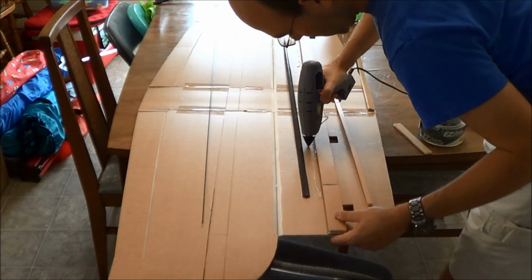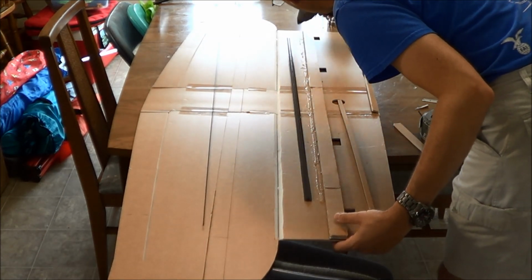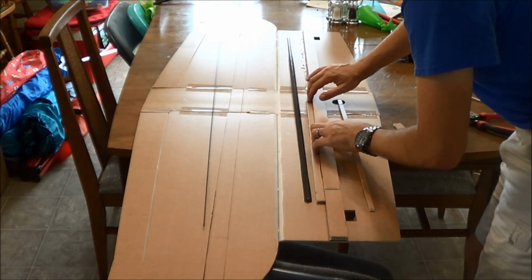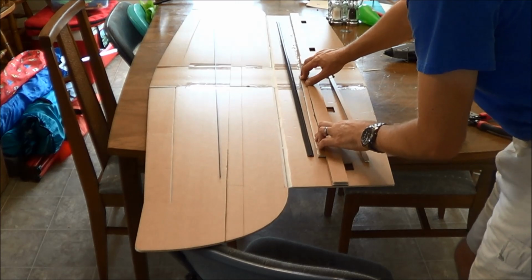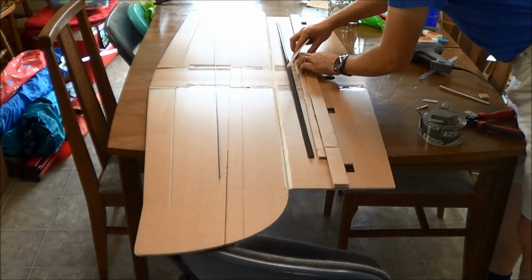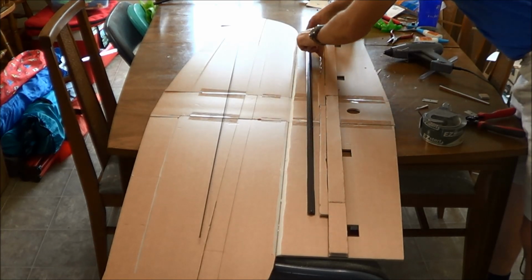And we can let this fairly secure into the bottom of the wing. If you notice, the spar I've got here does not extend the full length of the center section, and that's okay, because the primary G loads that we're concerned about are in the center section of the wing. That's why I'm just using scrap foam board here to do this anyway, if you can't tell.